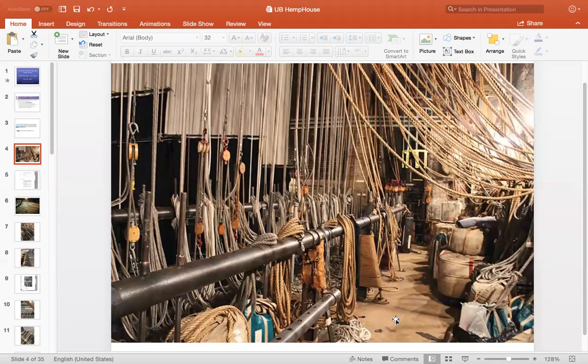It's a lot of work to use one because you don't get as much lift every time you extend the block and bring it block to block after pulling on the working line, just because it's a 5-1. So you only get 1/5 of the lift every time you collapse the blocks. So you have to restart.